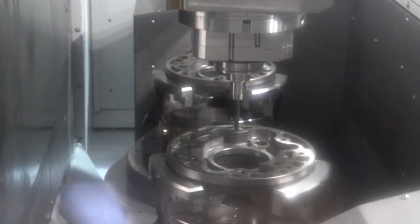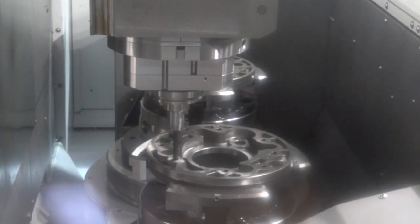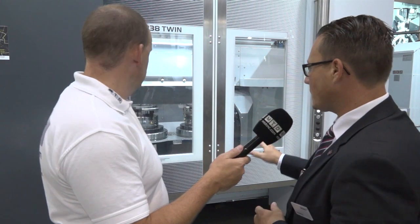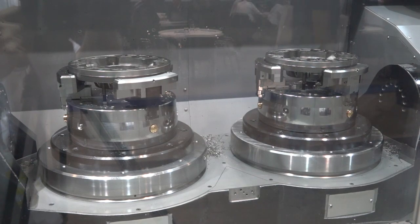We can see here now — this is turning round — so this is where you've got your 5th axis, your machining on a 5 axis basis. Correct, this is 5 axis. We have a bridge with two 4th axis motors, so there are two torque motors in the 4th axis, and we have two NCC 500 tables with a diameter of 500 millimeters.